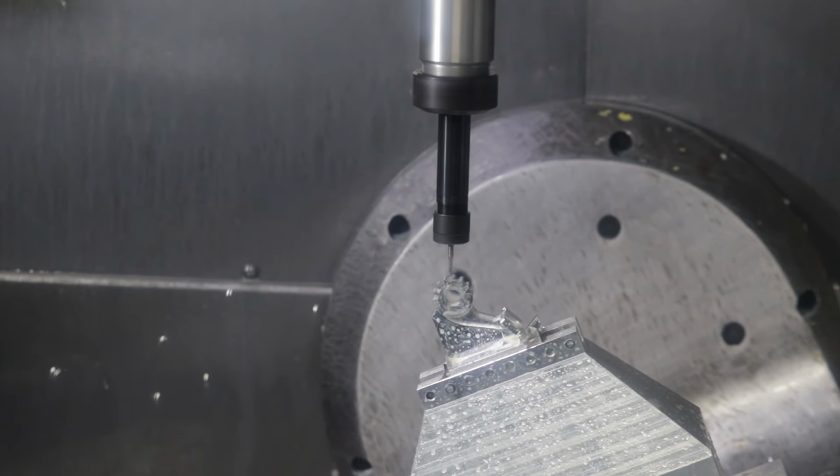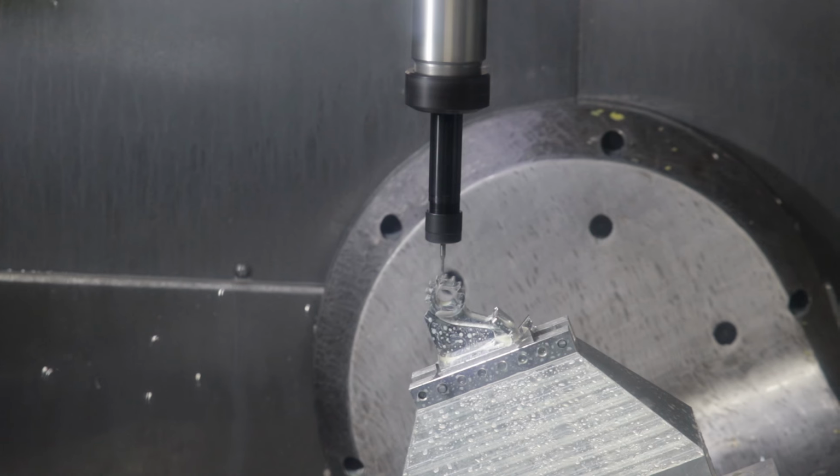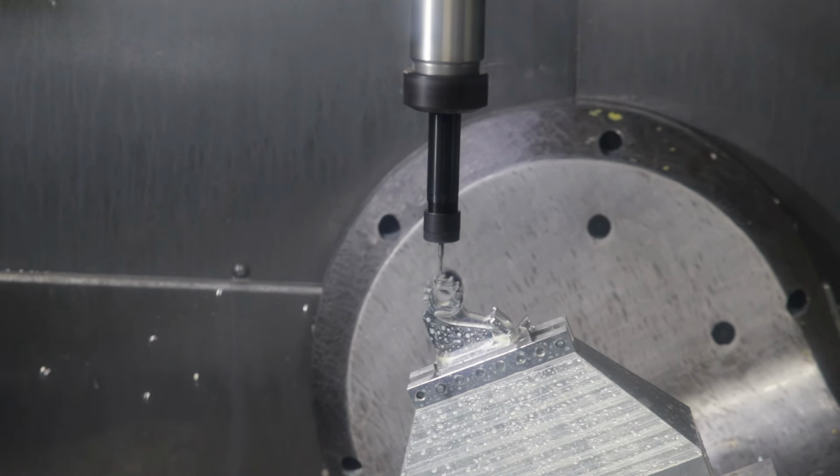And there we went past top dead center, so the part had to rotate 180 degrees in, I guess, the Z axis, so that we could then roll the part to the left again. With this mill, it really just likes to roll to the left past 180 degrees. It can only roll to the right maybe 30 degrees. So it has to figure out how to work its geometry to finish the swarf cuts on the other side of the part, basically.